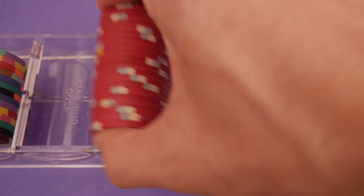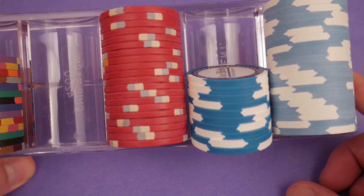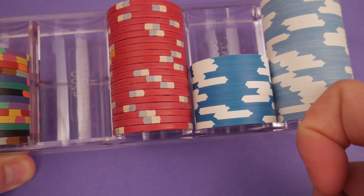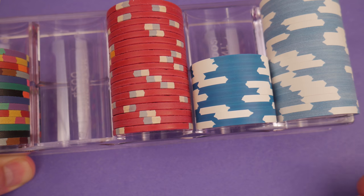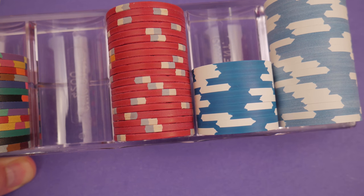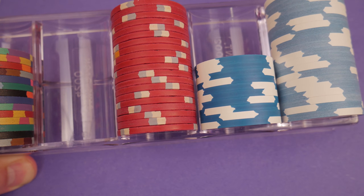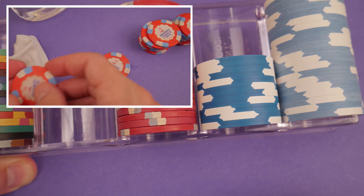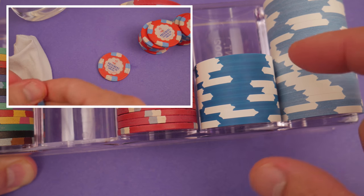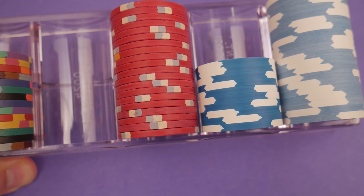You can see clearly there is a difference between an oiled chip and a non-oiled chip. These are the same — they looked like the un-oiled ones before I oiled them. They actually develop over time: when freshly oiled they still look pretty light, then they darken over a couple of days, which means the oil really seeps into the chip. Also remember that mineral oil never cures like boiled linseed oil — there are no heavy metals in it, it won't harden over time. So it always stays fluid, which means if you put too much on your chips, you'll have pools of it on the bottom of your trays. Don't overdo it.